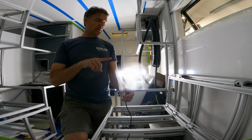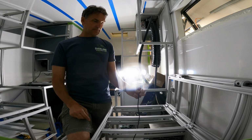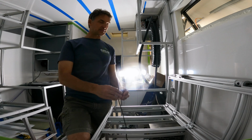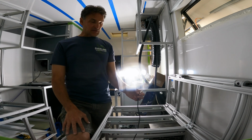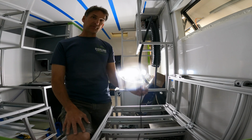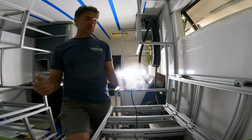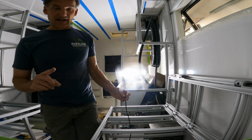I'm going to hook it up to my batteries, which are right here. I'm going to actuate this up, and I got to hold it away from the bench while I do that. Hopefully I have my positive negative to the right. Seems like black and red, positive negative. It's just going to go the opposite direction if that's not the case. It's already bottomed out. So we're going to test this out for the full stop so I can make sure that I've got my bracket cut and drill holes right. If so, I can replicate the same thing for the other side here. So let's get this thing cut down and test it out.